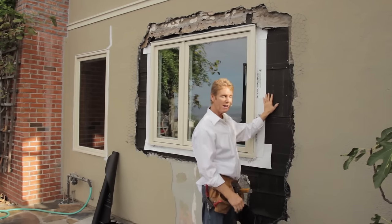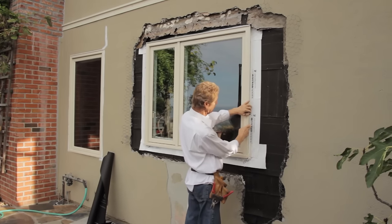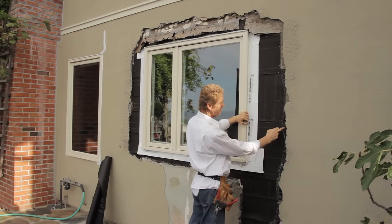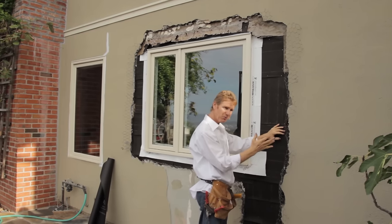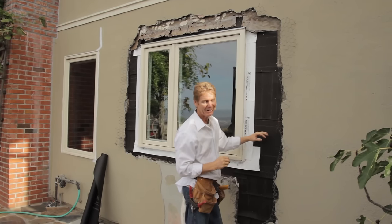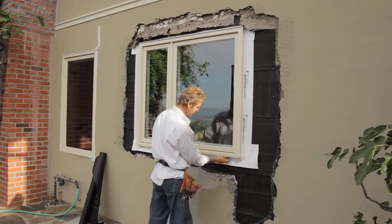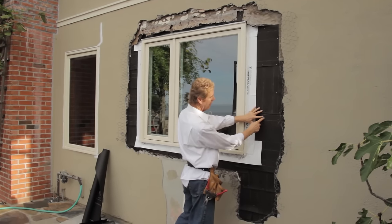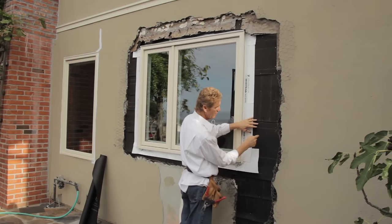The gypsum board is great when you're putting it on, but if you have to repair something like this, it's a nightmare. So what I told the contractor is to go ahead and take it from stud to stud. You'll find that if you pass this stud here, the board — granted, when you put it on it serves its purpose where you don't lose so much mud — but to try to repair something, man, that's a nightmare. He put this window in with a straight flash all around. But if I take a hammer or staples and put it into this gypsum board, drywall board, it just crushes it.